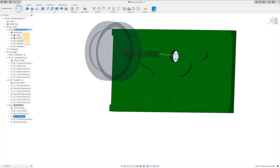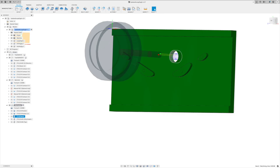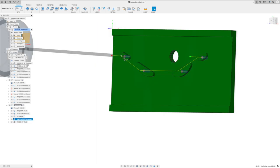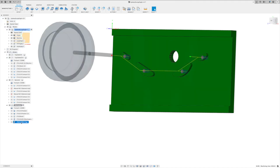We're going to go ahead and bore out that spot where the bottle opener is. Again, I've got that set up because that is going to be where I'm going to be able to align this piece in the future to continue to set this up for repeated use on the jig. That's going to be my XYZ lineup area. And then I'm just going to go through and drill and tap some 4-40 holes in there, and that's what I'm going to use to bolt that down. So that's the operation on the jig plate, pretty basic.